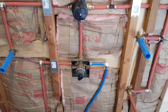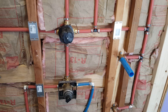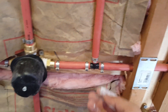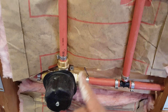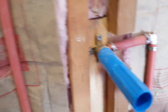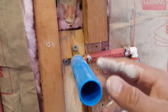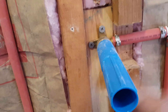As you cycle through the six positions, each one activates different combinations of fixtures. The bottom valve supplies the water, and the diverter directs it. The piping material here is PEX — a plastic that resists about 220-250 pounds of pressure. You have plastic and brass fittings; use brass fittings especially for female adapters because of expansion and contraction concerns.